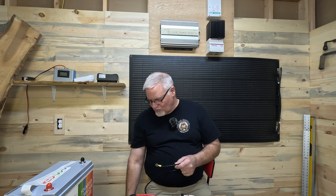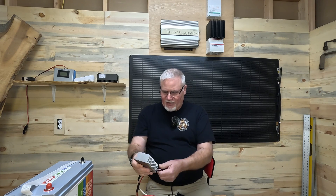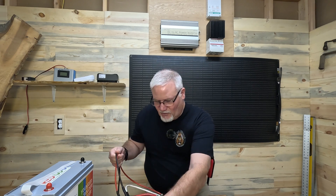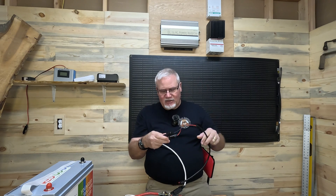The negative side goes directly to the step-up converter, which I have here — and it is kind of warm; they do get warm, folks. It's your step-up converter: it has your battery-side cables, which look like 8-gauge cables to me, and those go to your source power — your 12-volt or 24-volt battery. Then you've got your yellow and black cables, which go to your output going to the power station.